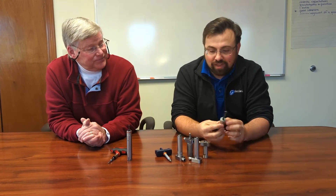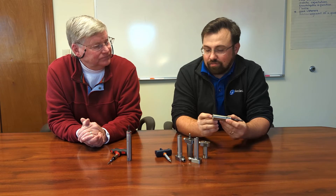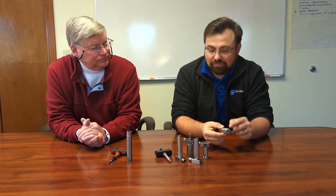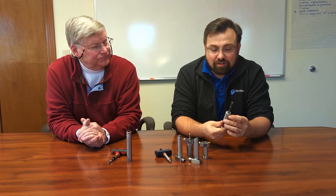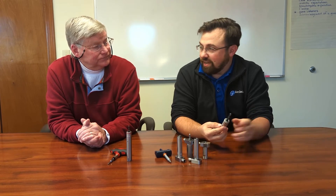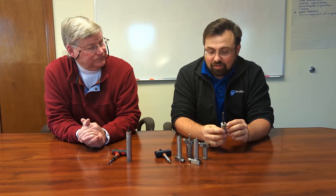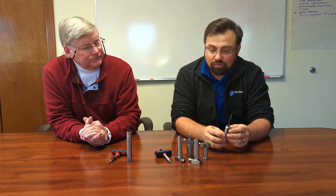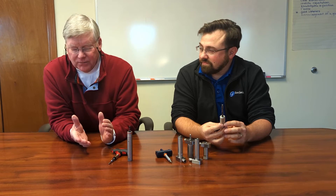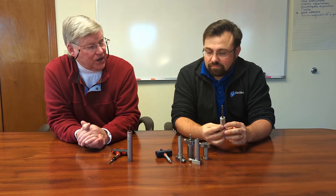This is a really good option for that — where you have a much larger than normal drill shank diameter but you're still operating in a Swiss environment. It gives you the ability to easily plumb into your system. We can connect either through the rear with an MPT, or put in an M5 on one of the flats if you have to connect through the front.